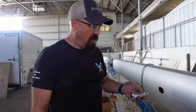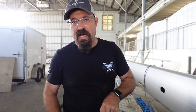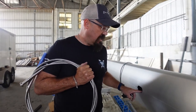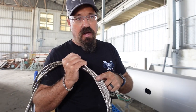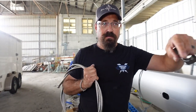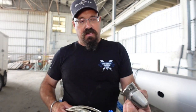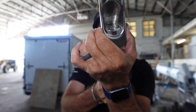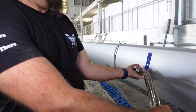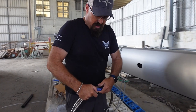On the inside diamonds, there are two small cables — I think 10mm — and then two larger ones that I think are 12mm that go on the outside. The smaller ones stabilize and isolate the mast to be straight left to right. The two larger shrouds or diamonds attach much higher and much lower on the mast — those are what put the rake in the back of the mast to create that backward arching bend. To install these with this type of fitting, you feed it through, it feeds all the way around, and this right here will seat on the inside to retain and hold the cable.